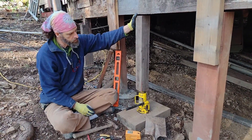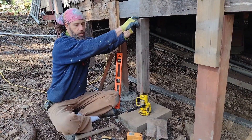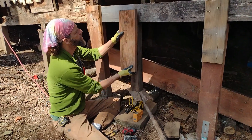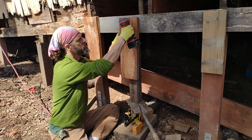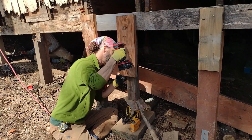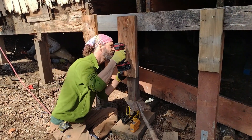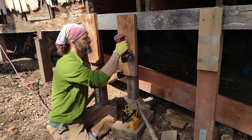I cut a temporary post — it can be a four by four or four by six, whatever you're dealing with. Usually a four by four is sufficient depending on how much weight you're lifting. Once you get that measured, cut it, and stick it in place. Before putting it in place, you put a two-by-eight or similar piece — about 16 inches — and screw it off on the beam as a scab. Then push your post into place, right on the center of your laser line, and screw it into that scab.